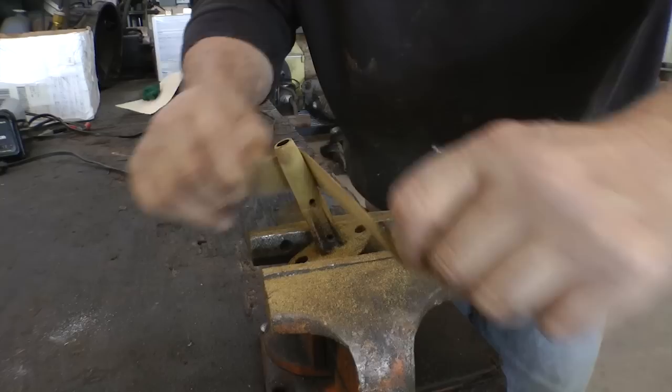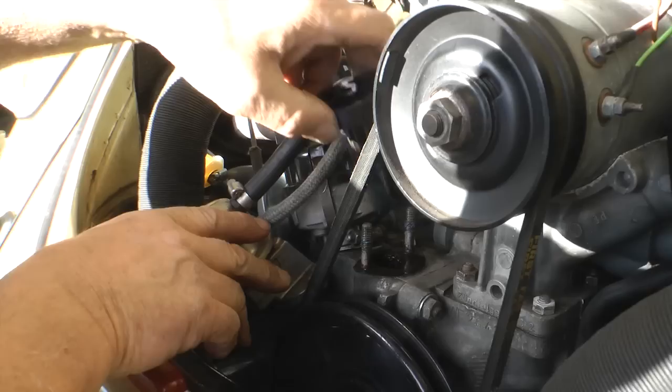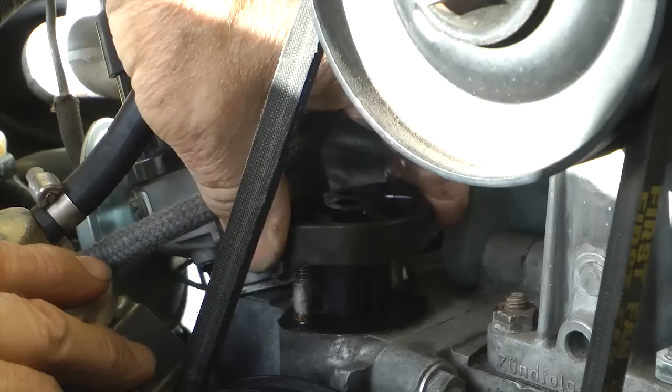What you want to do is take that stand out — you can see the stem that sticks out of the block that my dad has here. You just put the top end of the stand in a vise and start sanding down that stem. Just to get a little bit off, you can use some sandpaper or put it on a grinder. Then you want to make sure that when you put it back into the block, the stand flops right in.